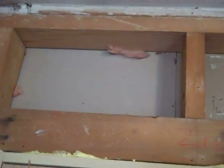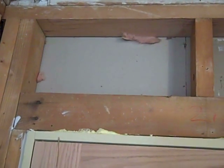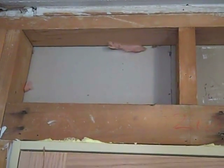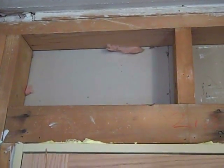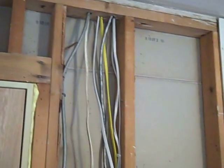We prefer to use spray foam where it cuts down on labor costs, but because of the cost of spray foam, dense packing cellulose insulation is probably the most economical and best way to seal any stud cavities, whether it be retrofitting an older home like this or new construction.